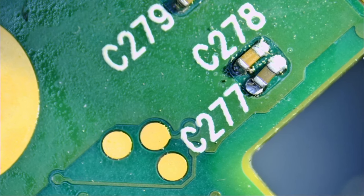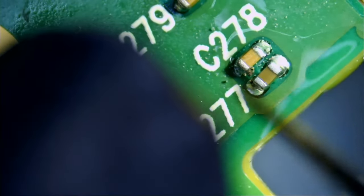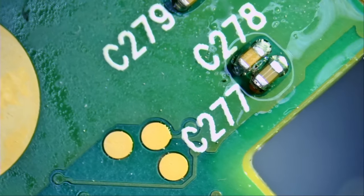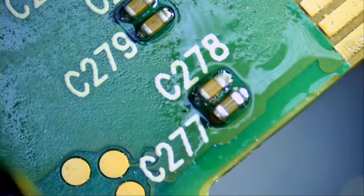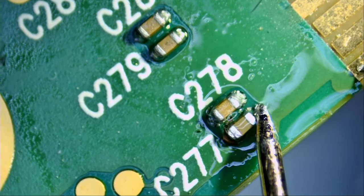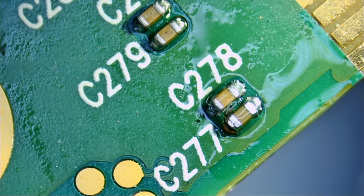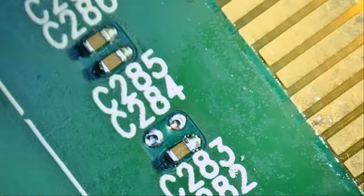And that cap is soldered. Let's add some flux. And we're gonna gently go over it. Let's measure and see if we still have a connection. Meter in diode mode, and do we have a connection? Right here, and we do. Awesome. And do we have a connection from the bottom? And we do. Great. Now we're gonna mask that component so it's solid in place. We'll do the masking later. Let's go ahead and do this one.